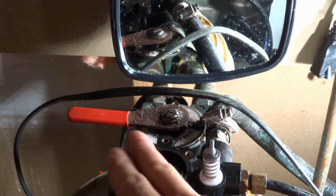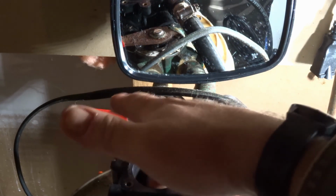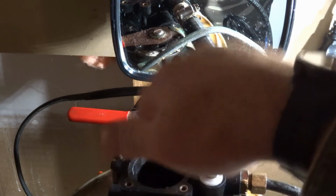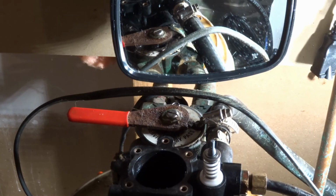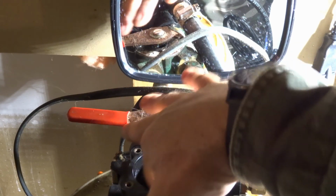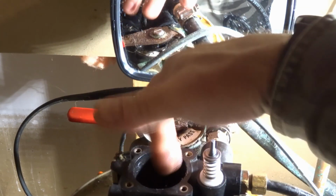Let's put the valve back in here. What I noticed with the parts that I ordered, they're already coated with a little bit of silicone lube. I'm not too concerned about that, but the inside here is very dry leading in. So I'm just taking a small amount of the silicone lube and giving it a very thin coat. Don't need much. Again, it's just going to help things slide in easy and hopefully prevent any damage. Make sure it's clean in here. It is clean.